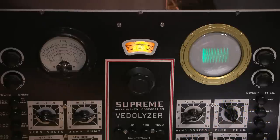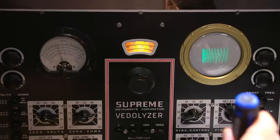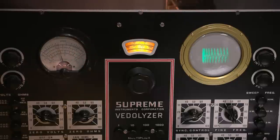Now the order is not all that incredibly important. We're just looking for maximum gain at this point. And I think we're already there. I'm just going to retune one here again. One more time, I'll go through this. Very touchy. Two. Three. And that is about it. And that's tuned now to 456 kilohertz. And that concludes the IF alignment.